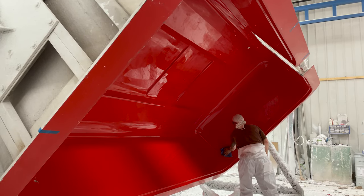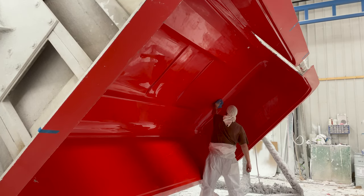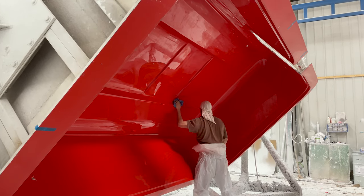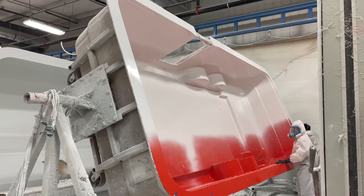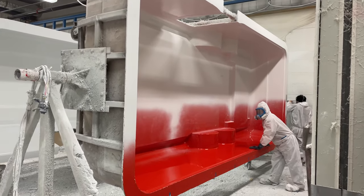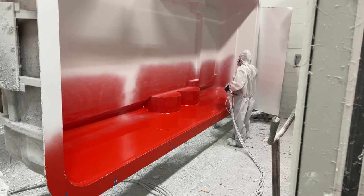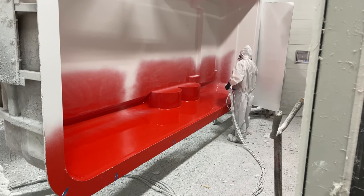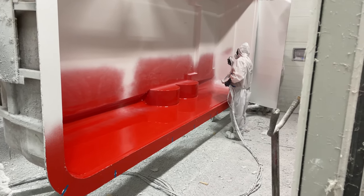To make sure that the product comes out of the mold really easily, it's like greasing a baking pan. So what they're doing here is putting a release agent on. After they've put the release agent on, they will spray the gel coat. The gel coat is essentially the exterior of your fiberglass travel trailer. You can see this gel coat going on — they've done one half of it and spun it around to complete the second half of the trailer.